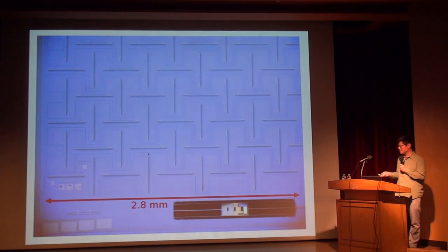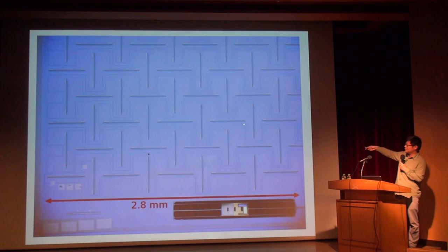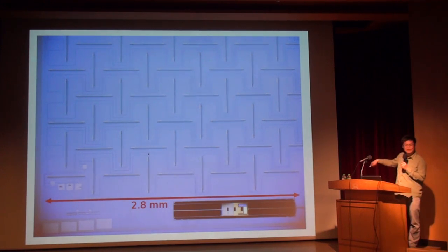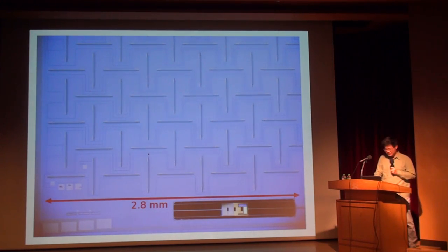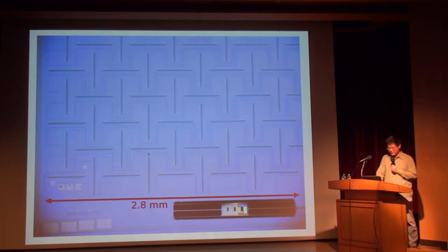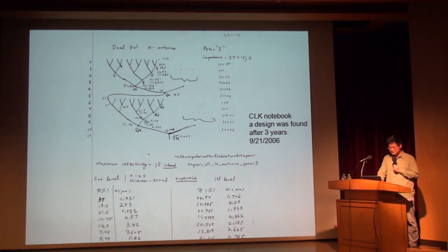And if you do the subtraction, there's another detector here collecting the horizontal polarization. I don't remember which one goes to where, even though I designed it. But you know the idea. You take the difference of the two detectors, you scan, and you do complicated math to form a map. So the nice thing is, this is all completely lithographic. You can make lots and lots of detectors.